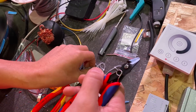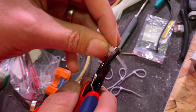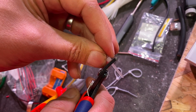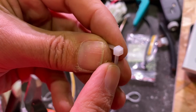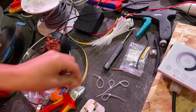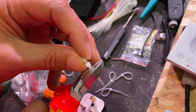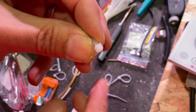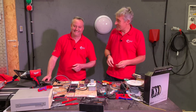What's the advantage of that? Normally in the electronic environment it's designed to get close to circuit boards. But when we think about electricians — let's just take a cable tie — we'll flush up the edge of the cable tie and slice the excess off. You can see a nice smooth edge. If I compare that with the traditional side cutter's beveled edge, you'll be a bit further away — yeah, you can see that overhang of the plastic. Not massive, but enough to catch your finger and in some cases draw blood.